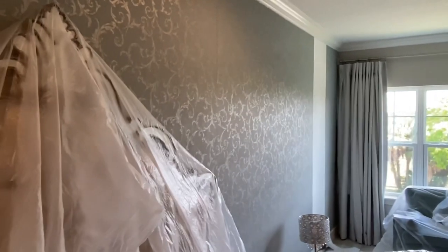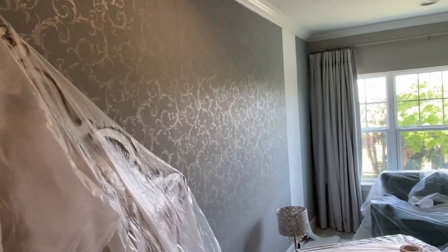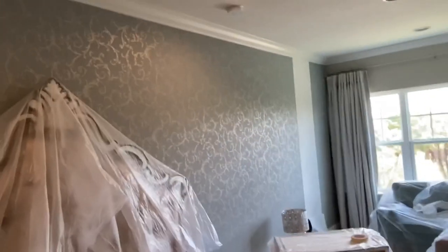Granted, that panel coming down fully would not suggest what this suggests, but since this and this one and that one all manifest an issue at the seam, I think we can safely assume that the failure of the wall covering to remain on the wall here is the same reason why the seams failed. And that's simply due to an insufficiency of paste.